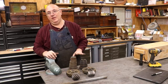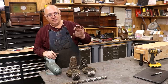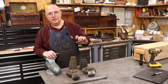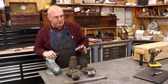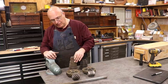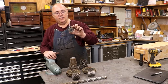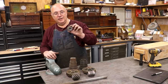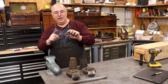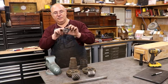Got some more parts for our lead attachment — we are definitely making progress. I've got to get that casting back. I sent the pattern off to Clark Easterling up at Windy Hill Foundry to make the bearing block to hold that little shaft that I had to make. Once I get that back and figure out the linkage between the dividing head and the lead attachment, I think we're going to be ready to go. Getting these worm gear sets was a huge help, as was the bulk of the change gears. This is going to save me from having to make a lot of gears, and doing that internal spline was going to be a real challenge. Now I only need to cut the outsides on two of these to get a full set, which is going to be pretty easy since I have some with the right spline already cut in them.